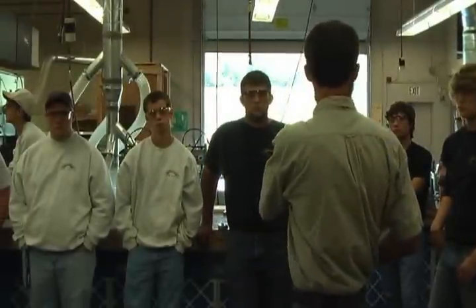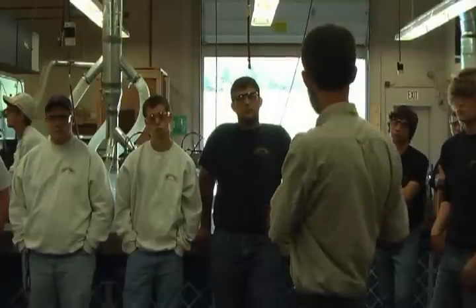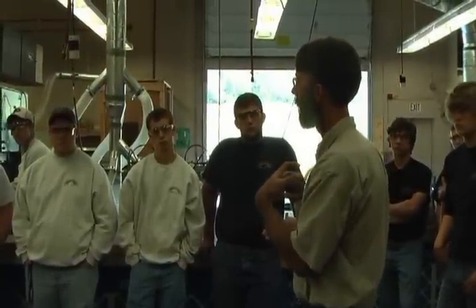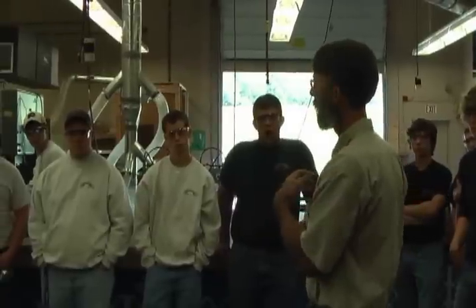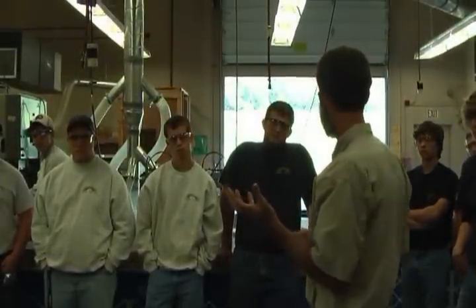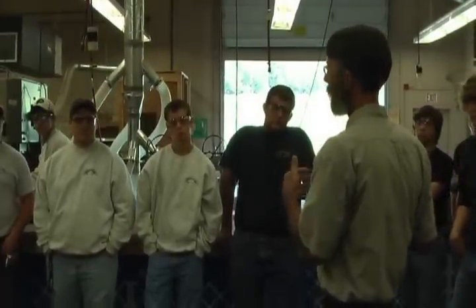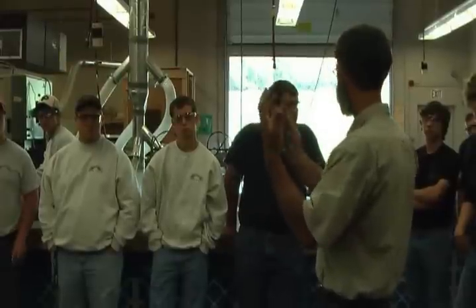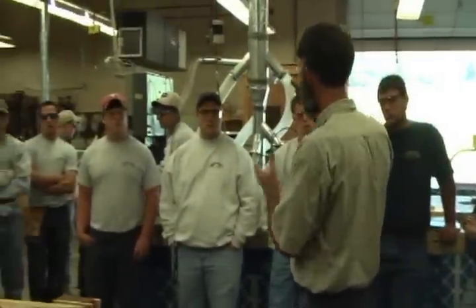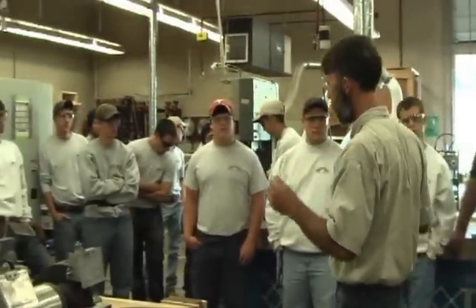Cabinet work, there's debate. Is that wax going to rub off on my wood and affect my finish down the line? My table saw at home, I've got a Delta Unisaw. I keep that table waxed all the time. And typically, if you're doing cabinet work, you're going to sand that wood again anyway. I have never had an issue where I thought this finish is splotchy because of wax. So I don't have a problem. The paste wax works well and it lasts like forever. If you don't use it, it's not going to wear off.